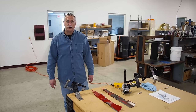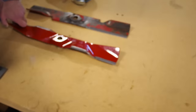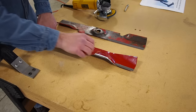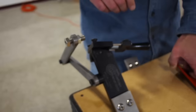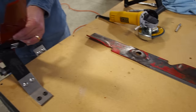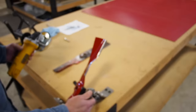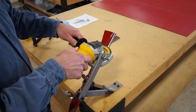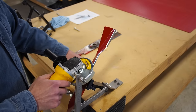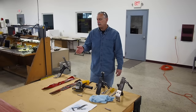I want to talk more about the mulching blade model and how it works and why it's designed the way it is. The head on this pivots so that when you're in the down position you get the correct 30-degree angle at the standard part of the blade. And then as it pivots up, it's the correct 30-degree angle at the top part of the mulching blade. The position point of this is designed so that as you pivot it up and down, your grinder is also correctly centered over top of the two spaces that need to be ground. So the outside section of the mulching blade is ground with the head down. When you put your grinder in, we're centered over top of this and it's in the correct position. Now when I move this up, this gives the correct angle and it is also centered over top of the grinding surface so that everything is correct.